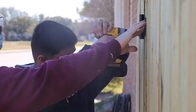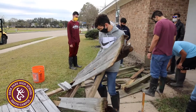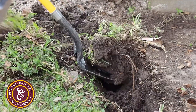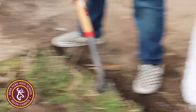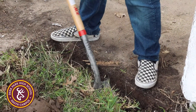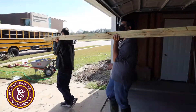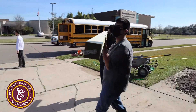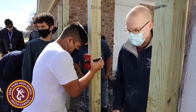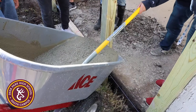Right now we're working on the fence and grinding it off because it was too tight of a fit. When we got here we dug out all the old posts, getting down to at least three feet into the ground and took out all the cement. After that we cleaned up the holes, made them 12 inches wide and three feet deep, then we leveled our posts, our 4x4s, put them in the ground, and after we had them all leveled we cemented them to the ground.